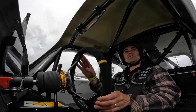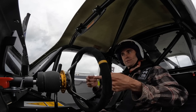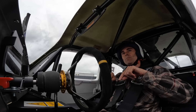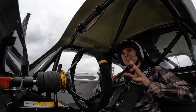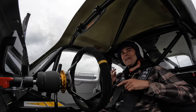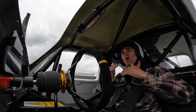This is the third run of the day. What I'm going to do is put it in front-wheel drive mode, do a burnout, get some temperature in the front tyres, then put it in rear-wheel drive mode, put some temperature into the rear wheels, and then put it back into all-wheel drive for the run. I think I'll do this one with traction control on again. The next one I'll do a front burnout, rear burnout, and try it with traction control off.